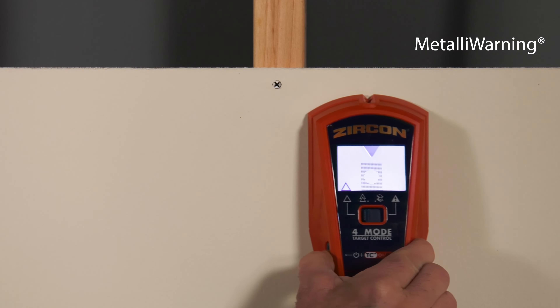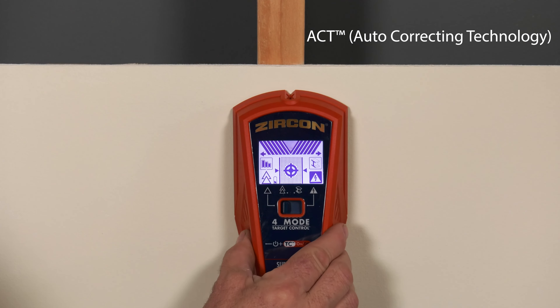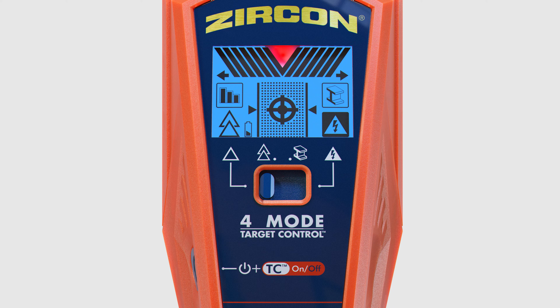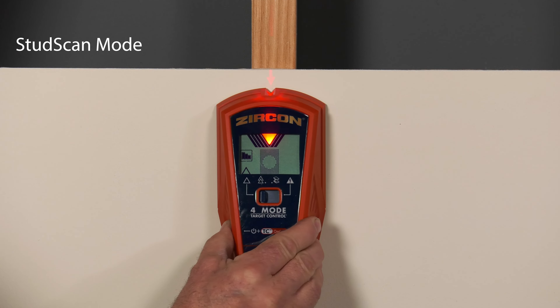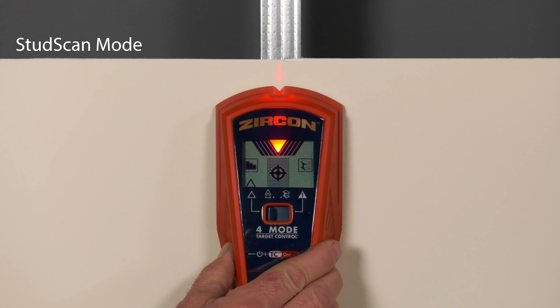Move the tool vertically down the wall and try your scan again horizontally. If you happen to start over a stud and move away, two arrows will display on the screen — move the tool horizontally back towards the direction of the missed stud. To find wood and metal studs, with the switch still at the far-left position, place the tool on the wall and toggle stud scan mode by pressing the power button twice, keeping the button pressed the second time. The backlight is off in stud scan mode. Wait for the beep to confirm calibration is complete and scan the area again. In stud scan mode, the stud indications will also indicate metal studs or metallic objects.